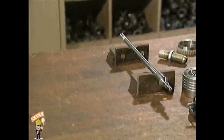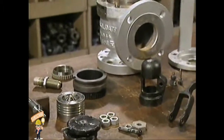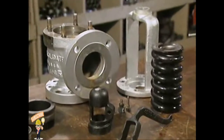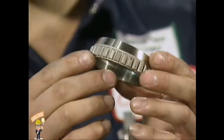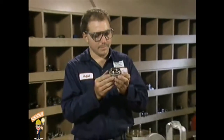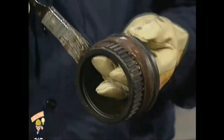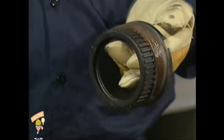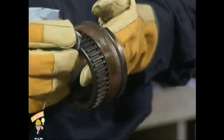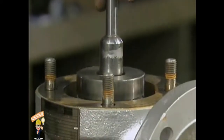After a safety valve has been disassembled and its internal components inspected, the valve must be properly reassembled and tested before it's returned to service. The valve reassembly procedure is basically the reverse of the disassembly procedure, but make sure you have all the correct replacement parts in perfect condition. Lubrication is also important — follow the valve manufacturer's specifications for the exact type of lubricant and application method. Typically, an anti-seizing compound is used on threaded surfaces. During reassembly, it's absolutely critical that the disc and the valve seat make perfect contact so steam can't leak through the valve.